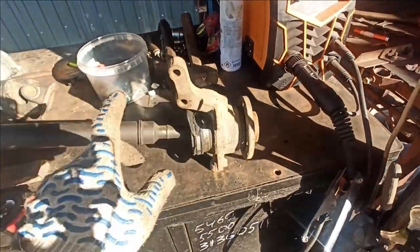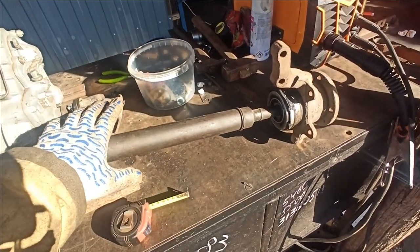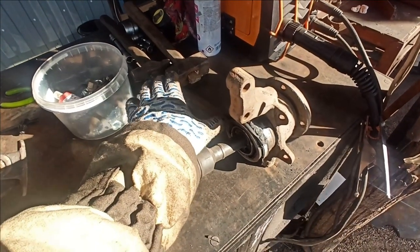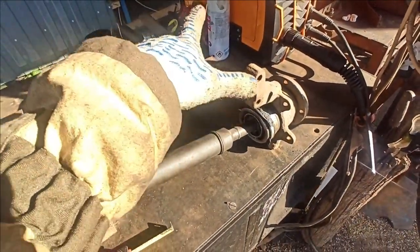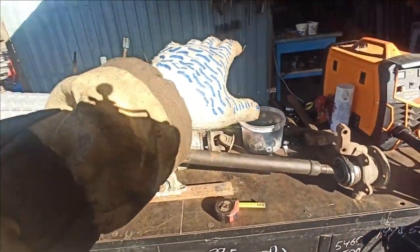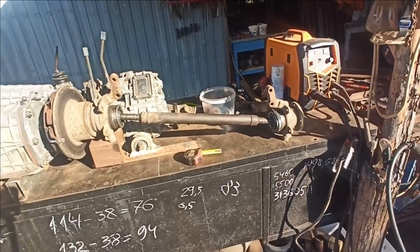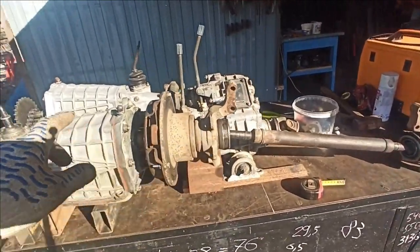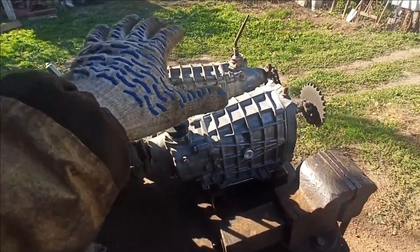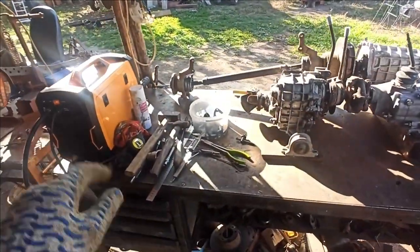What this gives me is the ability to shift the engine wherever I need — left, right, higher, lower — once the frame is ready I'll position it exactly where needed. I can also change the shaft length — shorter or longer, no problem at all — and place the engine as close as possible to the front axle unit, practically above the pivot point. The view will be excellent. I also plan to fit a front loader (KUN) on this tractor — the construction should come out ideal. All these assemblies will serve as an excellent counterweight.